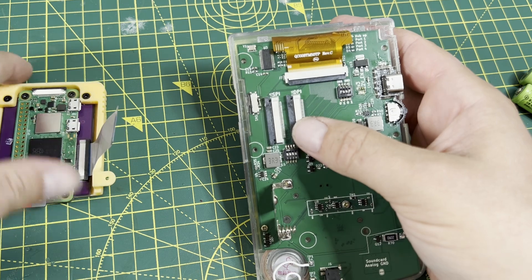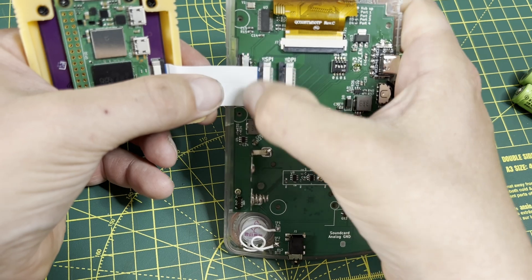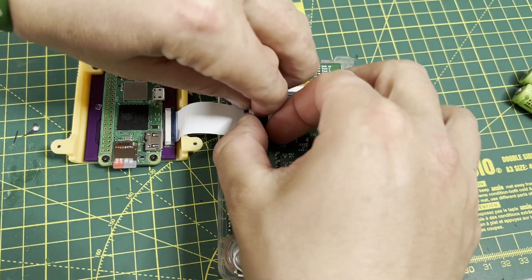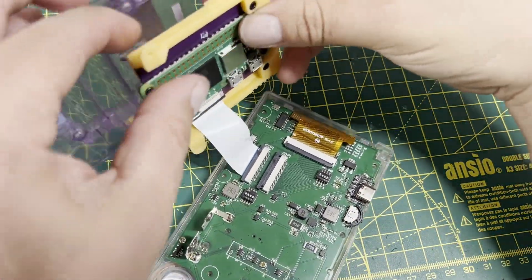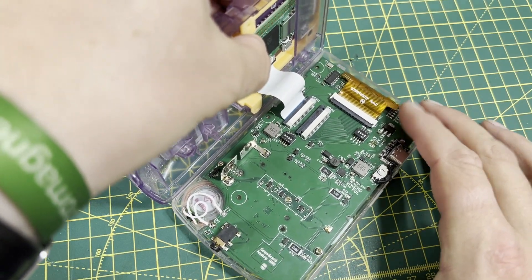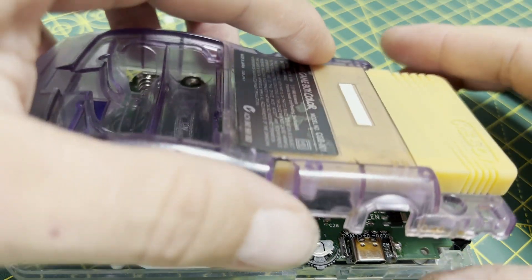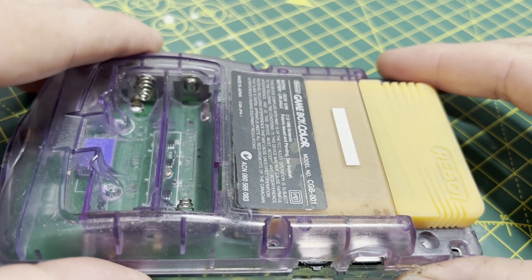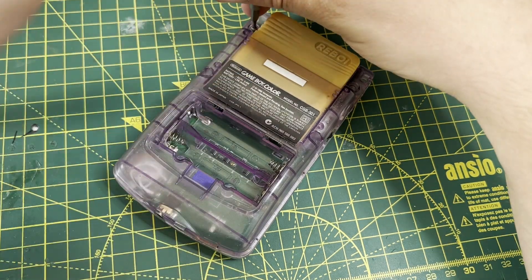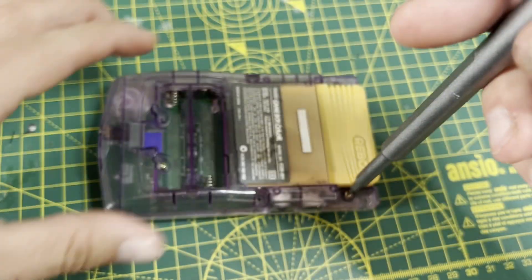Now it's finally time to bring these two parts together. There are two connectors on the back of the Reboi motherboard for whether you're using SPI or DPI to drive the display. We're using SPI for the moment, so you go ahead and plug the Raspberry Pi into the SPI socket, tighten that up, pop the Raspberry Pi into the back case of the Game Boy, and then simply fold the two together. I am so happy with this solution — I think it's as simple as it could possibly be. A single flat flex cable between the two halves and you just fold it up. You can then reassemble the Reboi just like you would an original Game Boy Color with six screws through the back shell.